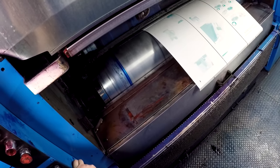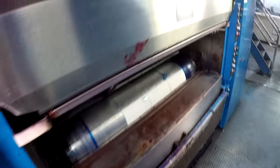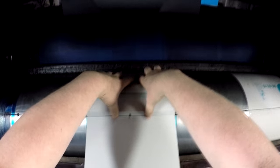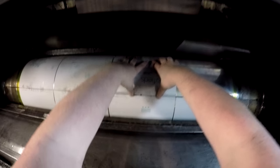When the plate slides in, there should be a very tiny gap at the top, then spin the cylinder around. For a new guy, putting the bottom of the plate in is usually fairly tricky. You have to grip the plate with your fingers to hold it in place, then grab the bottom of the plate with your thumbs, pull it up, and then push it into the clip. If you do it correctly, the plate should slide in, the clip should grab it, and the cutout should fit right over the dog. If you press hard enough you can actually get it to smash onto the dog — because the plate is made out of aluminum it can bend, and if that happens the plate will not register, so the press will have to shut down so that plate can be rehung. So be very careful.